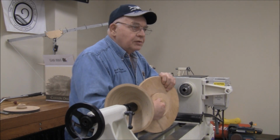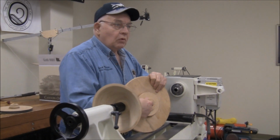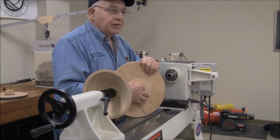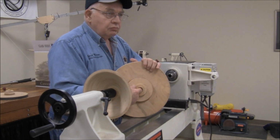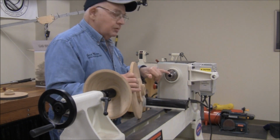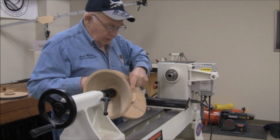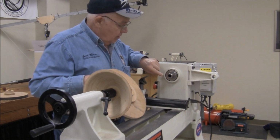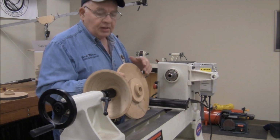You can drill this 7/8 of an inch and then tap it with a regular tap for metal, or you can buy the special taps that Beall sells for tapping this. You drill your hole 1/8 inch smaller, which gives you a 1/16 inch thread, which holds really solid. But this does have to bottom out onto here, so don't depend on the thread to get it lined up. It has to bottom out on this to make sure it's stable, solid, and stays on there.